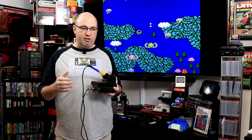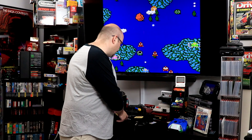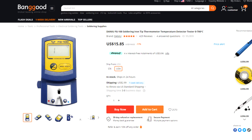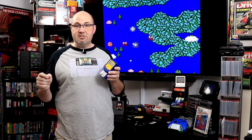In this episode, we're going to show you how we used this tool here — the FG100. There are 101 different variants of this, but it will allow us to calibrate our soldering iron tip per tip. We have multiple tips and we can calibrate each one to make sure that the temperature we are setting the soldering iron station to is actually the heat we are applying to our electrical components.